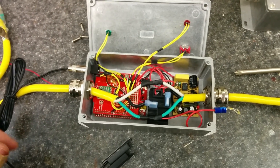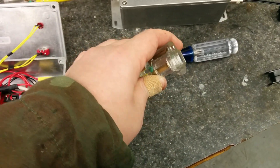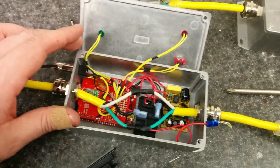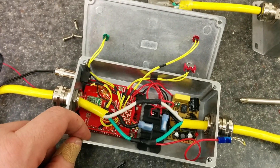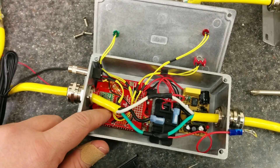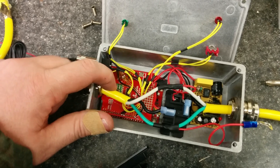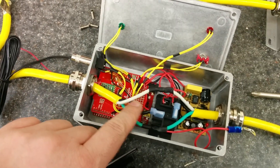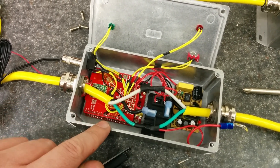The basic construction: I used a contractor-grade extension cord that has a nice neon light on the end so I know when it's powered up, and I split it in half. Inside this cast aluminum box I have a SparkFun RedBoard, which is an Arduino Uno clone, and on top of it a SparkFun RFM-22 shield, which includes the RFM-22 wireless radio underneath. There's also a nice prototyping area for the extra circuitry I needed.